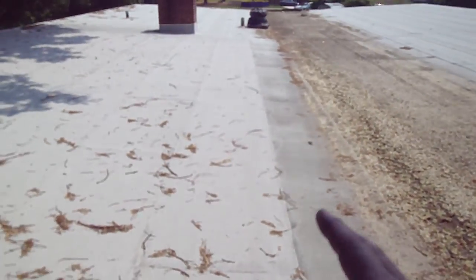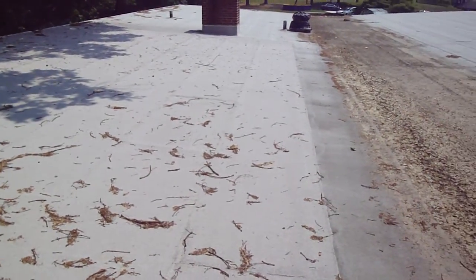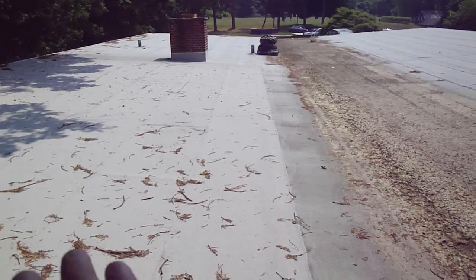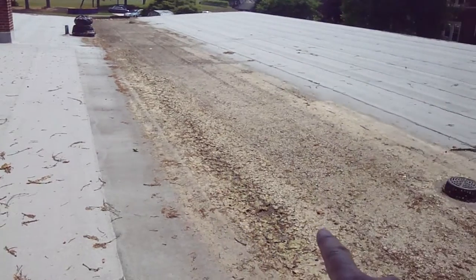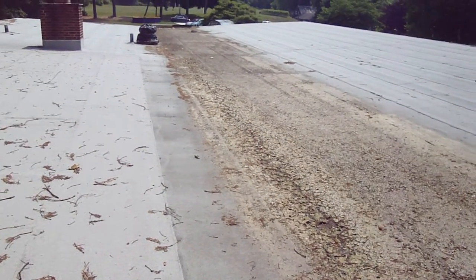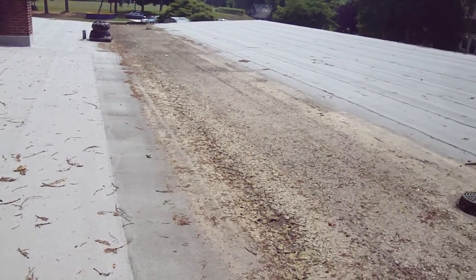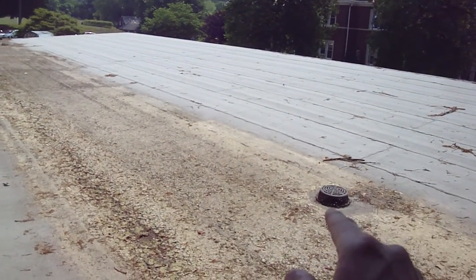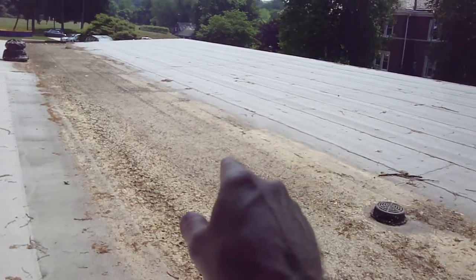this upper section up in here, well, this we just did in the winter, but you can see how much better it's wearing because the water doesn't pond up here. The water just rolls right down into here as soon as it rains. And again, the way to resolve this is to have a diamond cricket in the middle. That means the point would be here. It would go all the way up here, up that way.